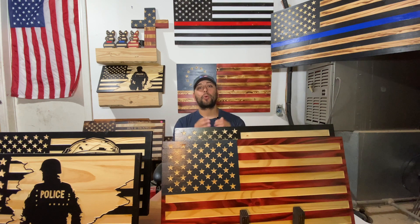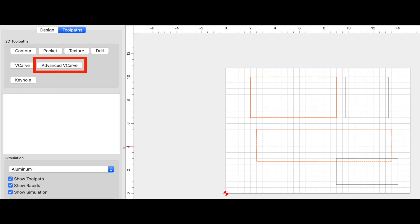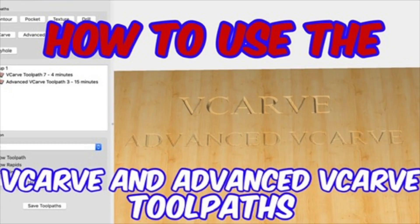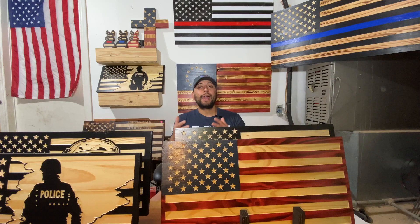Once you complete a basic American flag project, what's next? Take it in steps and stages. One thing you can do is create your stripes using a V-carve with a flat depth, or if you're using Carbide Create, using the advanced V-carve tool path. By doing this, you're going to better grasp the differences between the V-carve tool path and the advanced V-carve, or simply a V-carve with a flat bottom. Once you get comfortable with that tool path, you'll notice yourself using it all the time.